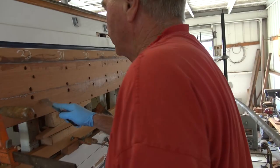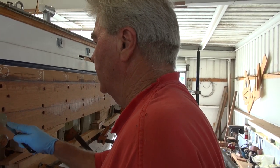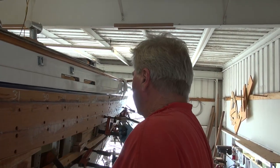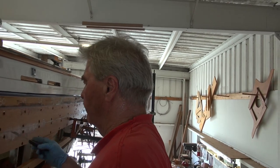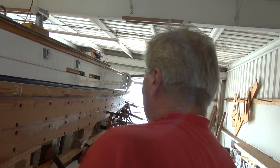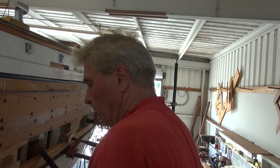Collision, corrosion, fire — and how do you get the rot? Fungus. In boats built like this, how does this plank ever rot? Because if it's built traditionally and the sun dries the seam out and it cracks, you get night after night of dew running down the hole, and you create an environment that's really good for fungus to grow.